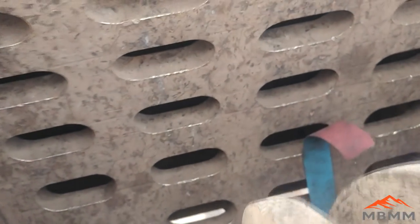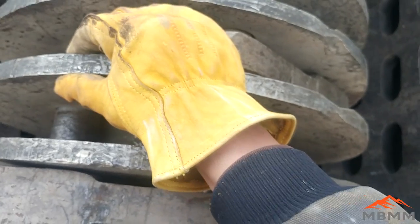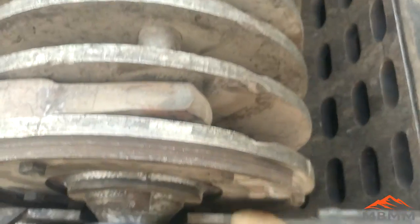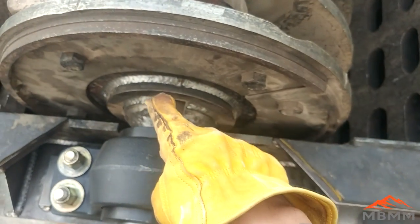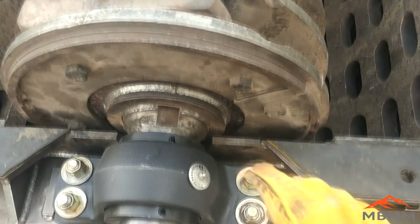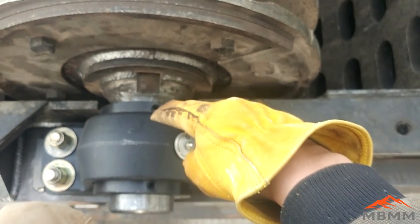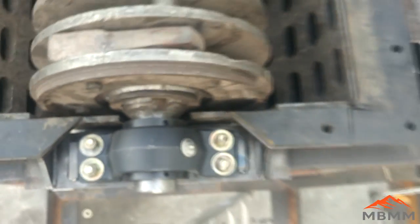This is about a 2 inch by 3½ inch screen down here, and it goes all the way around the bottom half of the mill. These rotors here are 3¼ inch thick steel, and these are the pins that hold the hammers on. It's a 6 inch shaft here that the rotor assembly is attached to, and then the shaft is turned down to a 3½ inch, and then onto these big spherical roller bearings.